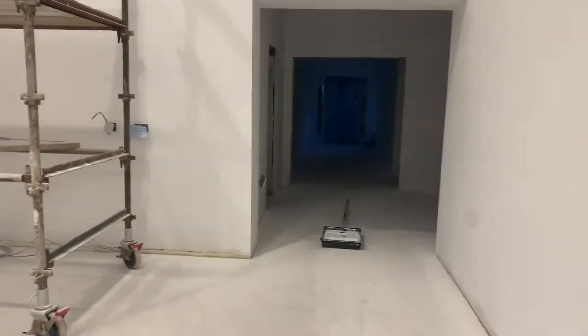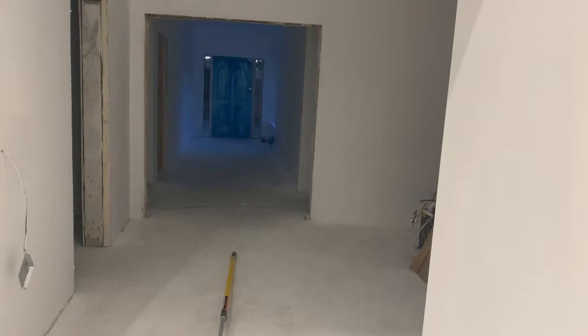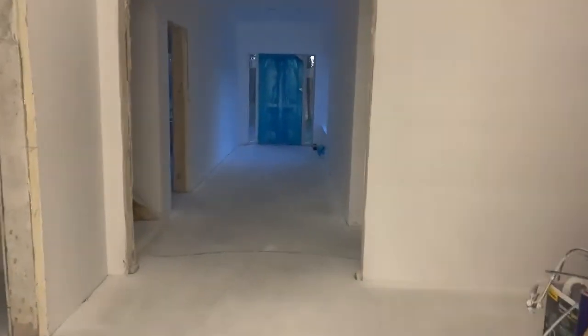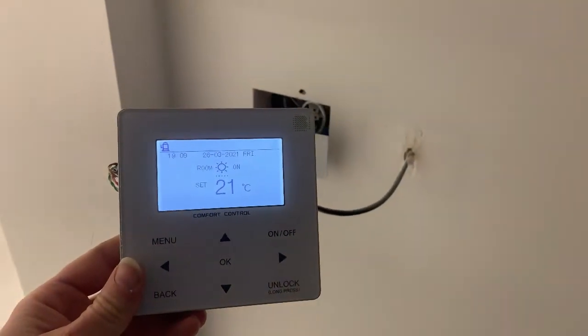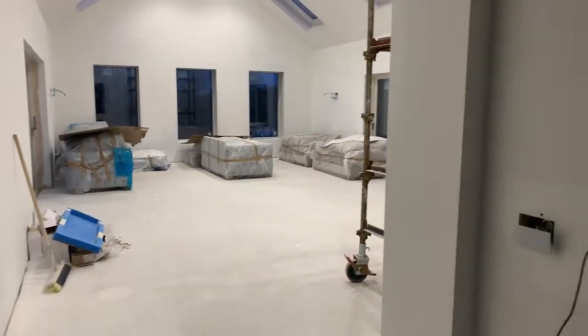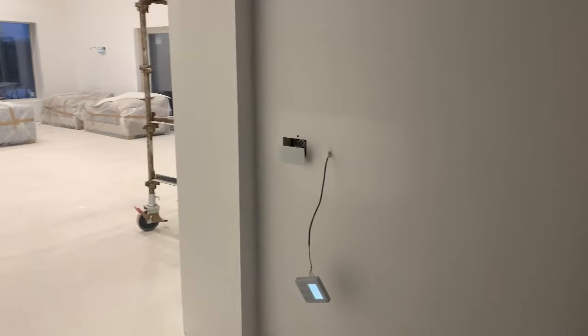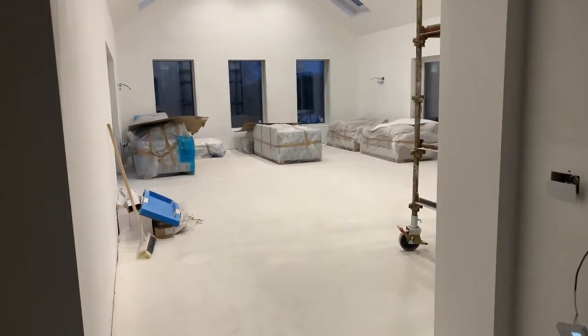In the summer time, if we find it's too warm — which is unlikely because of the insulation — we can go to our heat pump controller and set it to do a reverse cycle. What it'll actually do is pump cold chilled water through the floor and cool the building down. That's a nice option with that unit. It's currently set to 21 degrees and very toasty — it's currently three degrees outside. We also have a smaller 7.2 kilowatt unit going in for the garage on its own supply.